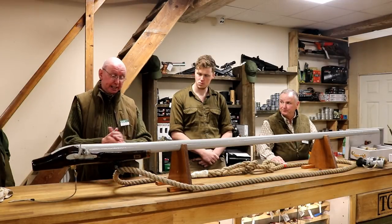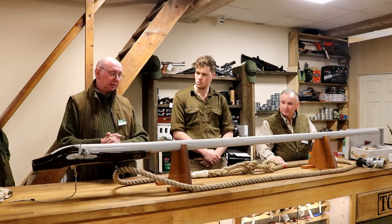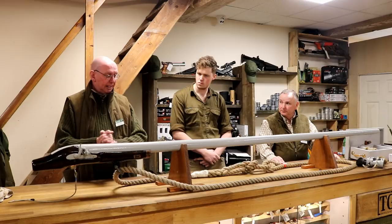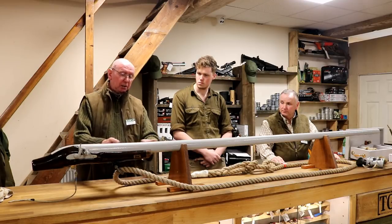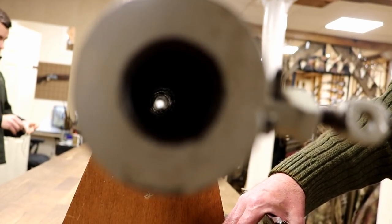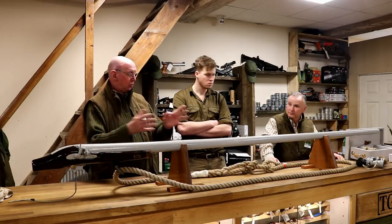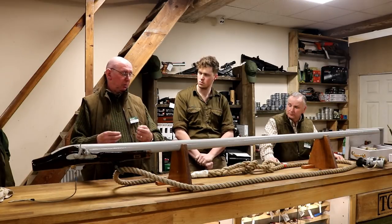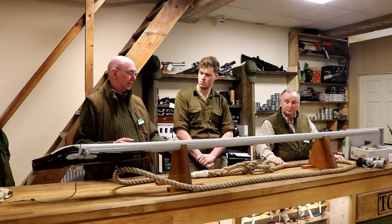Interestingly, because of its age, this gun was built by someone who covered the early development of the percussion gun. Most later muzzle-loading punt guns are just a straight tube internally, but this one is relief-bored — slightly wider in the chamber, tighter toward the middle, then opening fractionally about three feet from the muzzle before constricting again. This allows the pressure to build to its maximum and imparts the equivalent of a degree of choke on the shot as it exits the barrel.